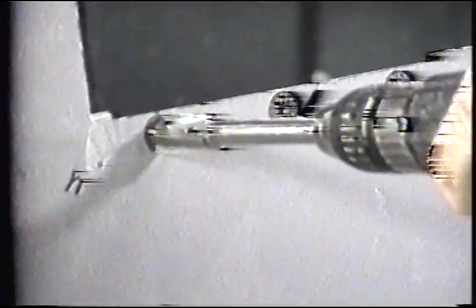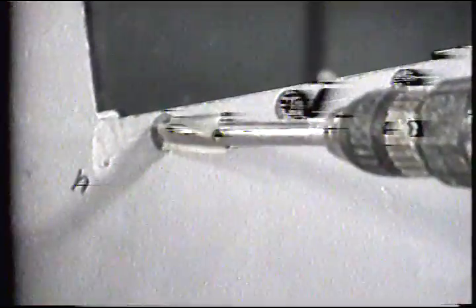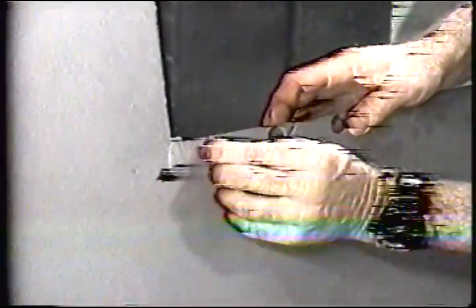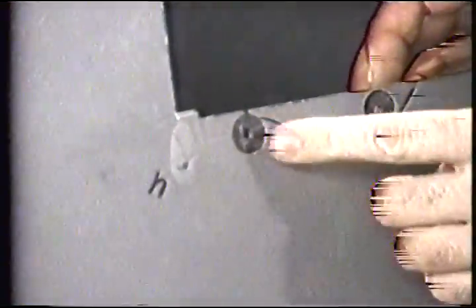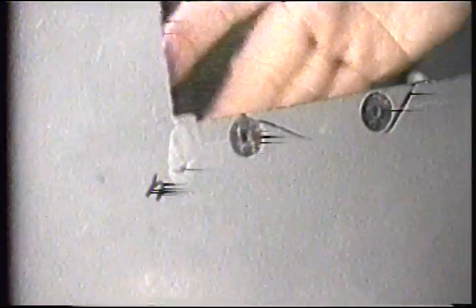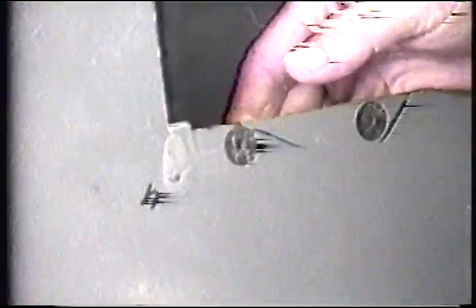Now, counterboring has already been done, but essentially you have to move through it iteratively, pushing and staying flat against the surface and make the cuts. Checking to make certain that you have resultantly gone the thickness of the material. Now, if you intend to put a Timmerman in here, I also suggest that you add a few extra plies of material here over the ones that I have suggested in the plans.